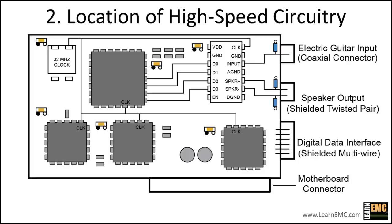In example one of this series, we were able to move the external connectors so that there was no high-speed circuitry between them, avoiding potential differences that can lead to one cable driving another like a dipole antenna. For this example, however, we cannot change the locations of the external connectors. The low-speed circuitry is in the upper right near the two low-frequency analog connectors, and the two digital interfaces are close together in the lower right corner, which helps limit potential differences. In the new layout, we'll keep analog circuitry near the analog I/O connectors and digital circuitry near the digital connectors.